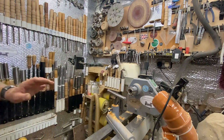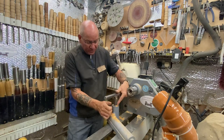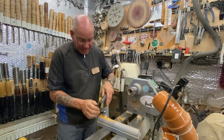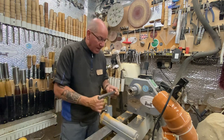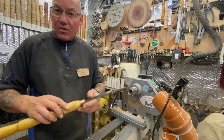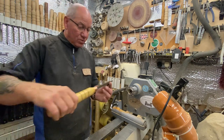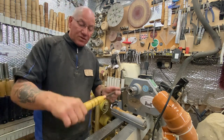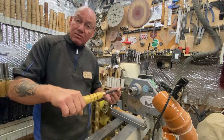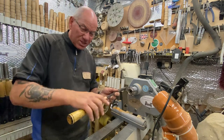It's simple. These things are very, very simple. Getting rid of torn grain, treating that sort of thing, very, very simple. It's just the angle of the cutter, what angle it goes in. That's why I use all these short handle ones, because I don't need big long tools. If they're grabbing and they're doing this, it's only the angle of the cutter touching the wood. Just change the angle, it's the tiniest little bit.